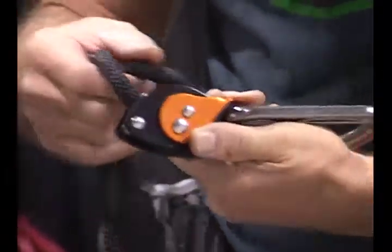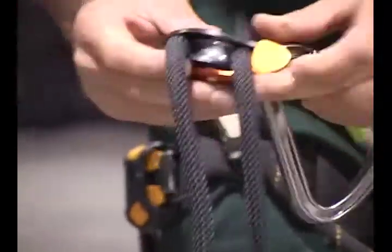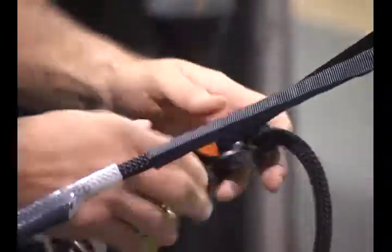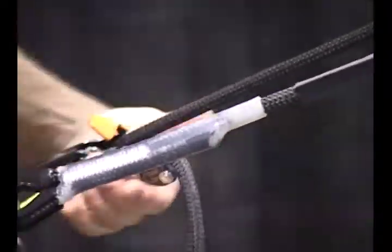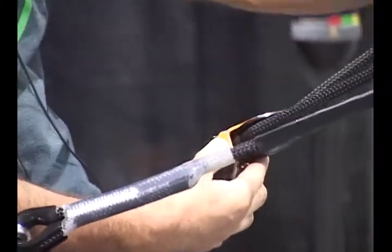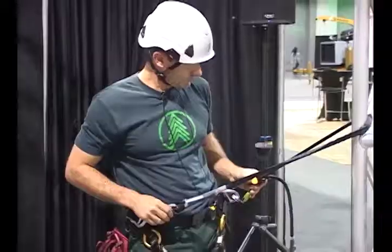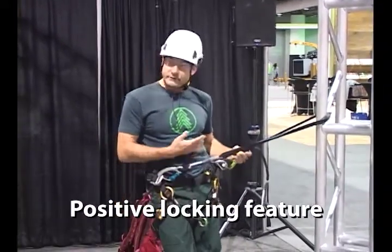You could consider this a static bollard that puts the weight of the bend in the rope, and then there is a pulley on the other side. That bending motion is what produces the friction. It's actually camming that rope back against what we'll call a bollard. It's very positive, very nice, compact, and very simple.